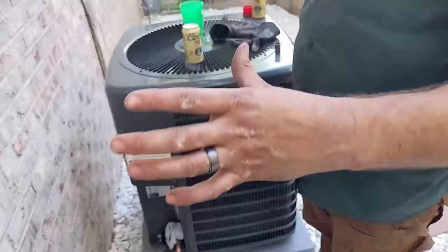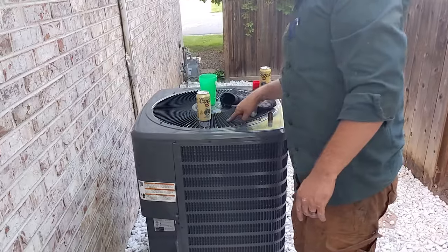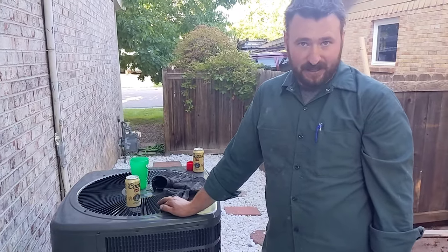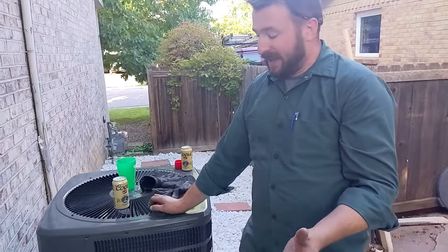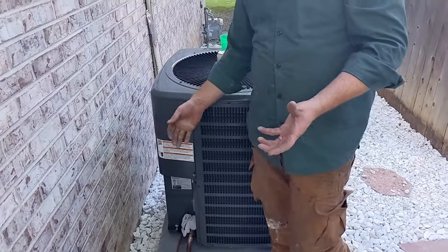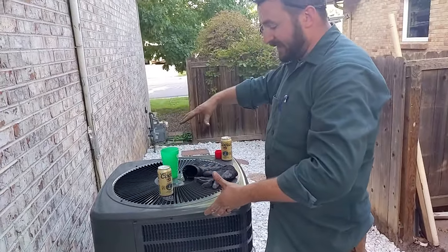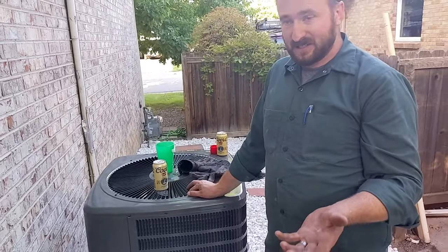But that line feels hot. But it's the hot line, correct. If you touch the line coming off the top of the compressor in here, you can't hold your hand on that line. That is all the heat from inside the house. Then when you touch this line, you can hold on to it. It'll be about 100 degrees depending on the day. So this cools off the refrigerant from inside the house based off the principle of heat goes to cold. That's the world of thermodynamics.